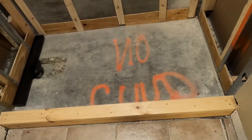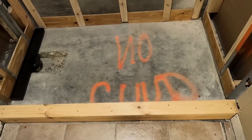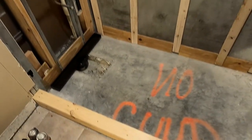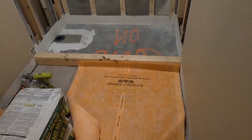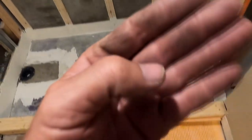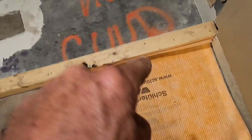Hopefully something here helped you. If you're going to do a condo renovation, I don't envy you. Right now I should have already poured the pan — normally on day one I try to pour it and give it time to dry out. I'm relegated to pouring it late today and I'll be ready to start tiling two days from now. Moving on to day three: the next process I went through yesterday is screeding out thinset onto my boards. I want the thinset that the KERDI is going to go onto to be preset and dried out prior to putting my KERDI down.